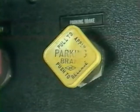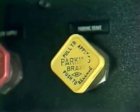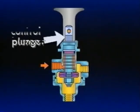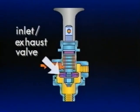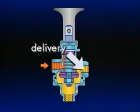The next component to be considered in the brake system is a dash control valve. The driver has several dashboard controls available. PP or push-pull valves are manually operable on-off air control valves. Pushing the button in places it in the delivery position. Most are pressure sensitive, like this Bendix PP-1. It consists of a control button, plunger, spring, inlet exhaust valve, and body. The body has three types of ports: supply, delivery, and exhaust.